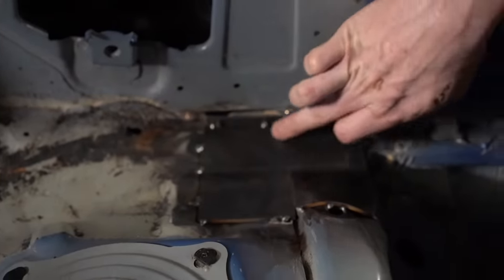So this is a really good start, especially since we haven't done an inch and three quarter cage in a 350 before. This is an excellent fitting main hoop for a first attempt. And then from here, I'm gonna save the file or the dimensions, and I'm not gonna make any tweaks because it fits well, but sometimes you would say, oh, for the next time I'm doing this cage, I could put this bend half an inch higher or lower, or make these half an inch wider or narrower, and so on. But we're really happy with the way that this one turned out, so we're just gonna remove a quarter inch off the bottom, put it back in, and tack it in place.